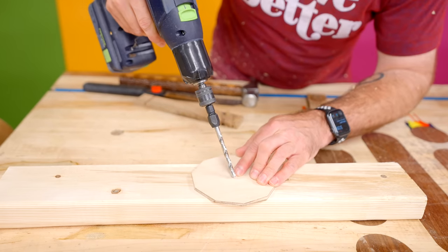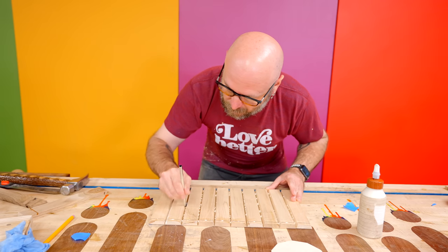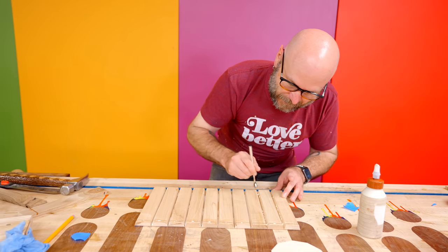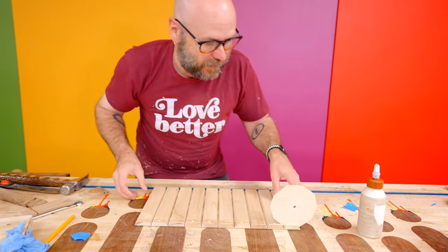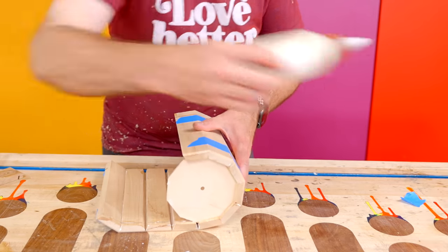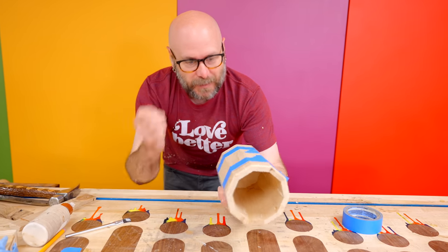We're going to drill a drainage hole so if you put in a wet utensil the water has somewhere to go. This does not take a lot of glue — this is all long grain to long grain, so no reinforcements and not much glue at all. Be careful not to have too much squeeze-out on the inside. We can stick our bottom in — this is so satisfying. I forgot to add glue on the last piece there. That looks really good, there are no gaps in there — all thanks to that digital angle gauge. I'm going to let that sit and dry for an hour or two, and if I find any gaps we'll fill those in.